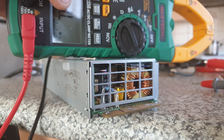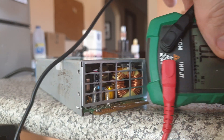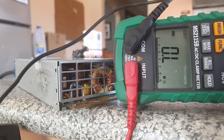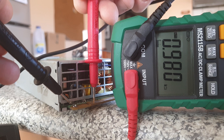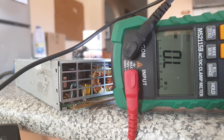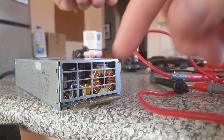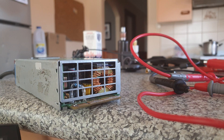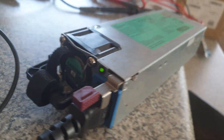I'm trying to do my best to let you guys really see what's going on. It is a 1K resistor from pin 3 to ground. So with the 1K resistor from pin 3 to ground and pin 1 and 2 joined together, I'll just go and hit the power switch. Got a tiny little bit of noise from the fan, green light's on.